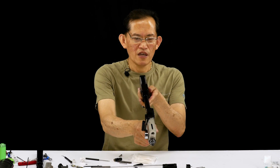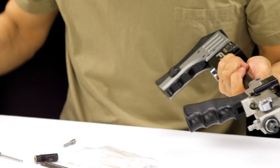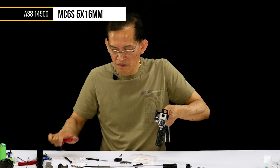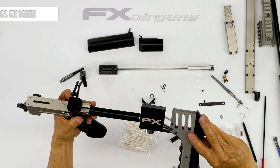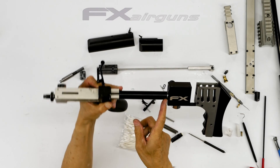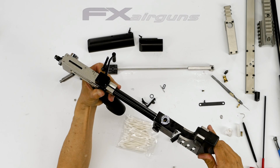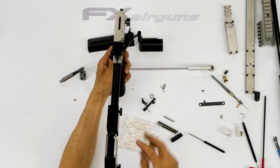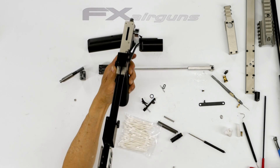Now eyeball this — you want to rotate it. Since it's locked, loosen the clamp here and rotate gently. Turn it clockwise — if you turn the other way you'll unscrew the reg. Rotate clockwise until the two blocks are eyeballed flush horizontally, then tighten it.